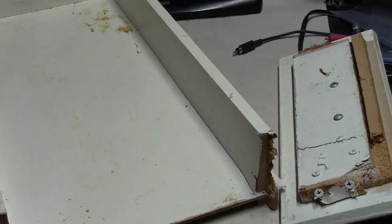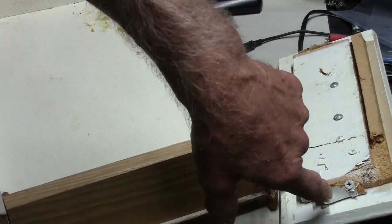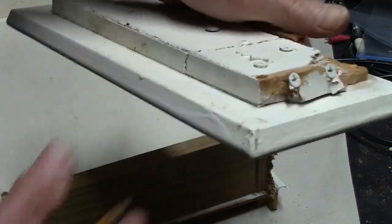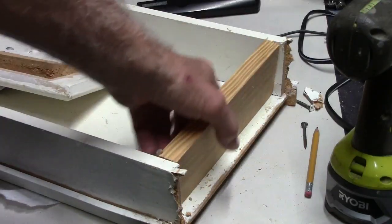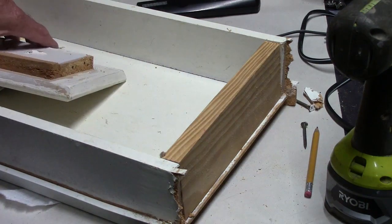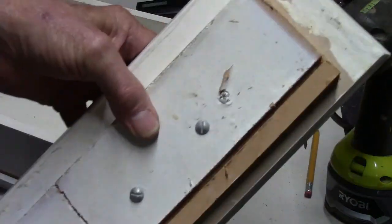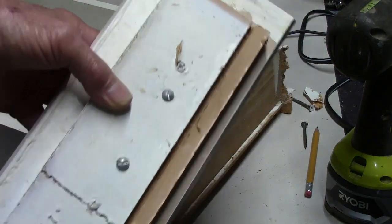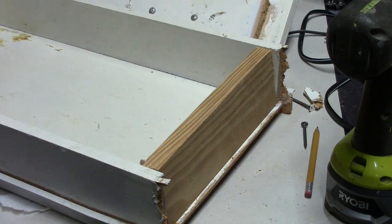Okay, now we get it to fit — it looks pretty good, just a hair bit smaller but that's okay. This is not factory; this has been broken once before, and you can see the crack there. We need to clean all this up. This piece is going to go right at that edge and we're going to screw it in. You can see the drawer bottom is sticking out just a little bit to catch the groove right there. Glue won't do any good because this is melamine — well, there's another name for it, it's been so long since I worked with this stuff.